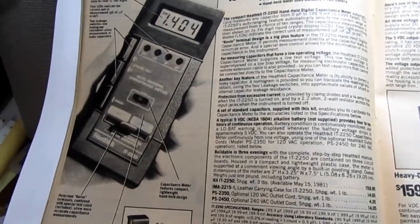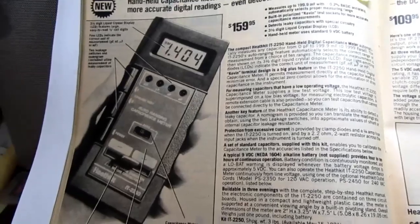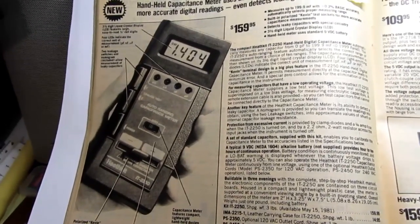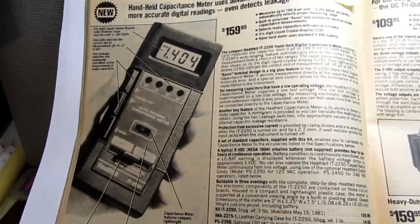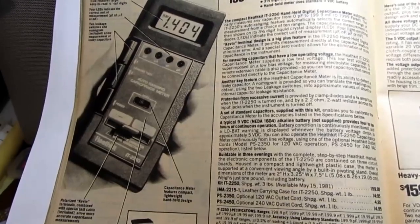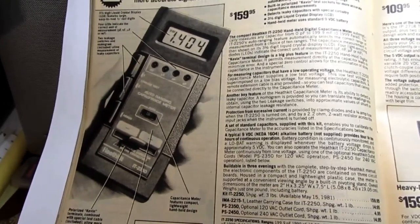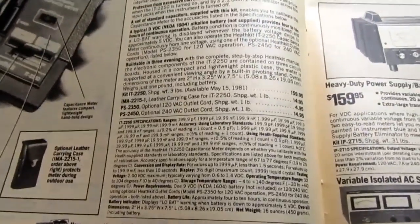And it was very nicely calibrated. I really didn't need to calibrate it, although I did obtain a new set of reference components. It did not come with the original ones. And I used a professional capacitance meter to read those values and then check them on this meter, and only the highest value, which was a 1,000 microfarad reference capacitor, I needed to tweak this meter slightly to match the reading. But otherwise it was in very good calibration, which is another mark of confidence.